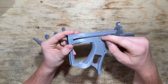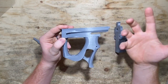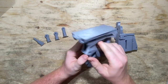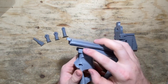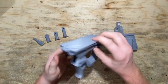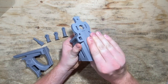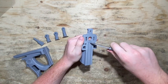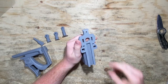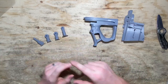On one of the pieces, the supports were already popped out — they were actually design-incorporated supports, not actual supports from the printer, but there's geometry there that pops out with some needle nose pliers. We are going to have to file down these little bumps later. Also keep an eye out for any stringy filaments that may have ended up on these pieces. For this guy, this piece actually pops out and it can be a bit tough. This whole piece pops out — it's scrap, it was just there to keep the channel nice and clean. So I'm just going to clean these up real quick.